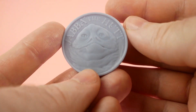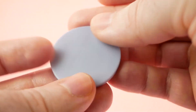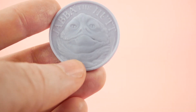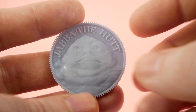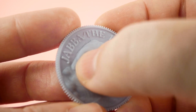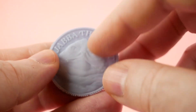I also wanted to show you a couple of other earlier versions. This was my very first one, just a proof of concept to see how it would turn out. I was experimenting with making the coin thinner, which I ended up not liking. It has nothing on the back and nothing on the sides, but you can also see there's some banding on this one as well. On this one, I actually used a hollow model of Jabba's head without thinking about it, and it turned out it left a void underneath, so there's actually a very thin skin on Jabba's head on the coin that allows you to push down on it — not great, because it can leave uncured resin in a little pocket. I had to redo that, and the banding issue also eventually solved itself somehow.